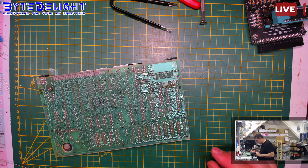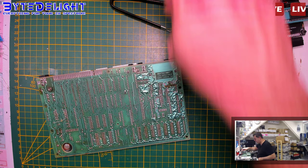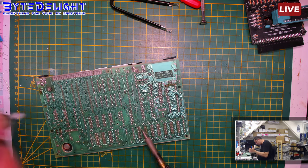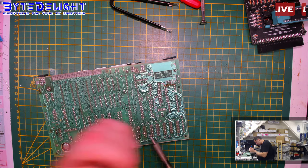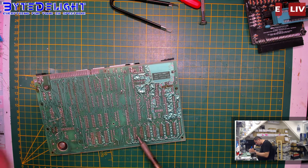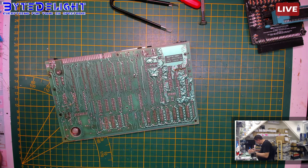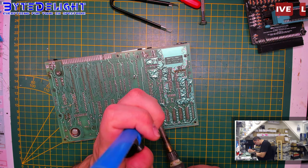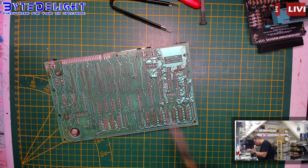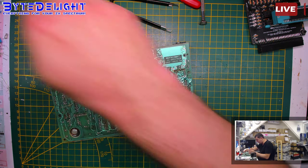Dark board not shown. Maybe it did, but because we didn't have 12 volts, I didn't let the diag card do its run. Because I first want to fix the power issue. And if you do not have 12 volts, you will get a picture output on the 48K. So it could work, yeah. But I don't like smoking transistors when I'm doing a diag run, you know. So the diag card shows defective chips, but assumes that you have a working power circuit. That's what I want to say. I would never do a diagnostic cartridge software run with a bad power circuit. I don't like that.